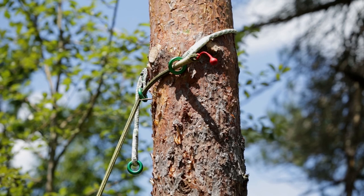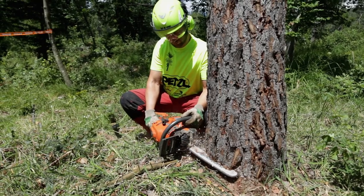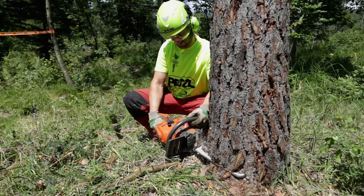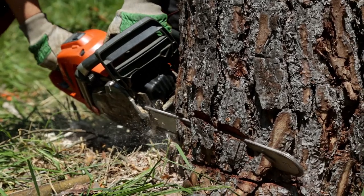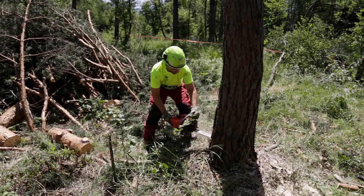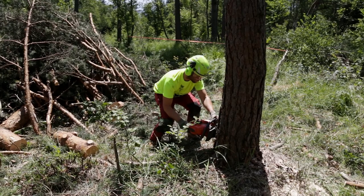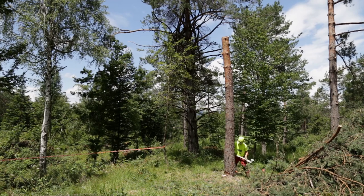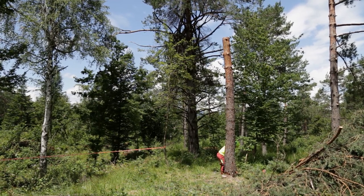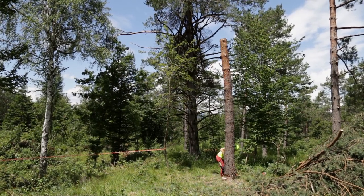When he puts all the equipment away from the side he can cut the rest of the tree trunk from the ground. For tree felling he has to put in the sink cuts in the direction of the fall, then continues with the felling cut. He has to make appropriate warnings and observe the area around him — before the tree falls nobody should be around. Depending on the circumstances he uses wedges or the corner cut to control the tree.